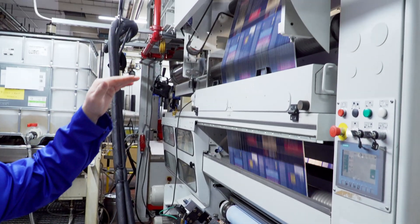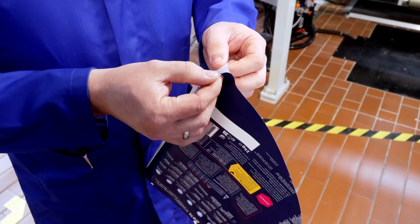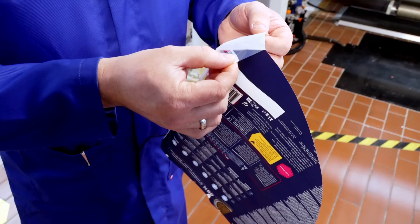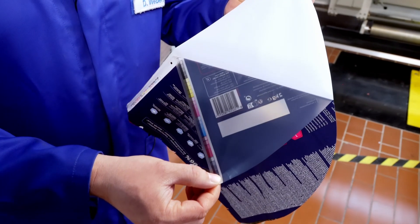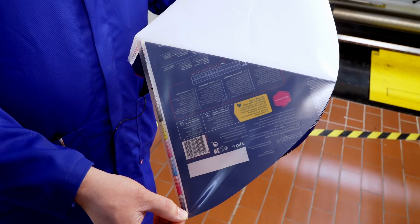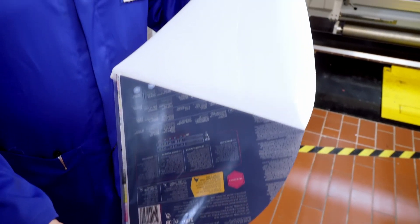Here we see a small section of a foil that has now been bonded in the laminating machine. This is basically a thin exterior foil that has been printed in advance using the gravure printing process, and here you have a PE foil on the back. Right now you can see that the material still separates well, so it sticks only slightly. The actual curing of the adhesive takes place in the roll in the warehouse within seven days, and then the material can no longer be separated.